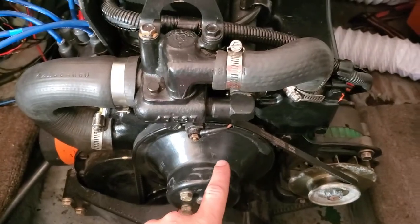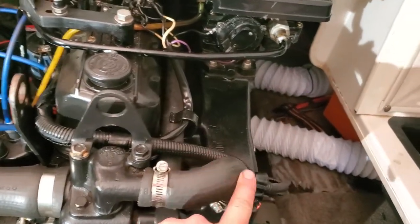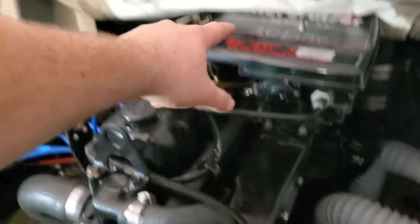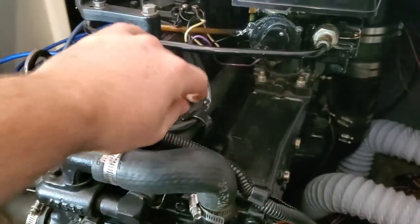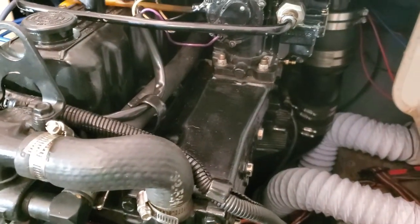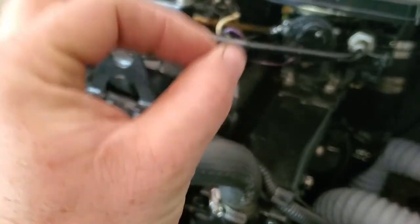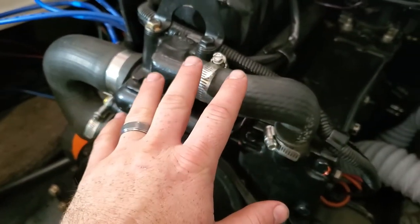Moving to your engine, you've obviously got your recirculation pump and your water inlet from the thermostat housing to the engine. Then you've got your thermostat, and the hose from the thermostat down to your exhaust manifold. This little hose back here is the inlet hose from the out drive — it runs all the way back to your transom, hooks into an elbow back there, and then goes to your out drive. Another thing you can do is pull this off — it's just a hose clamp — and blow through it with your mouth. If you're getting air to move through it fairly freely, you're probably not clogged up. With a brand new impeller the tolerances are really tight, so if you get air moving you can pretty much eliminate a clog on the out drive side.